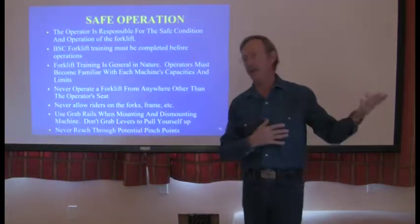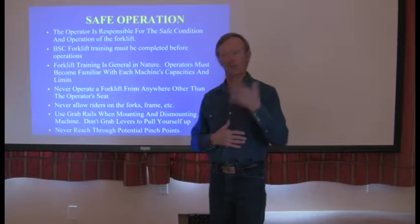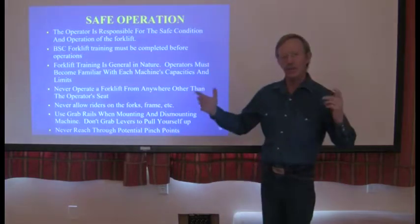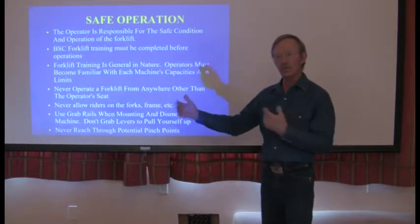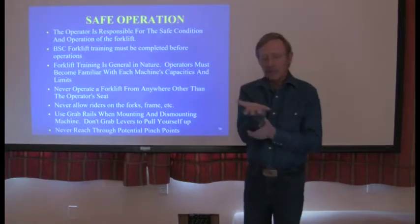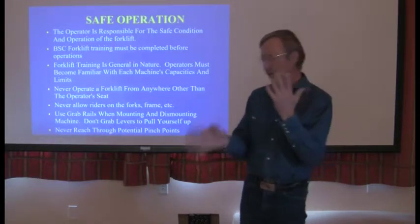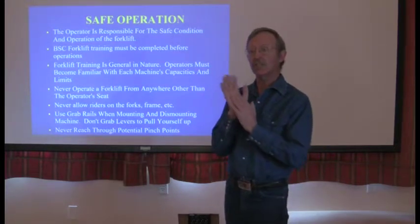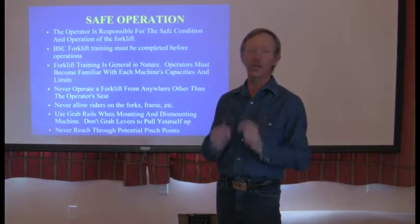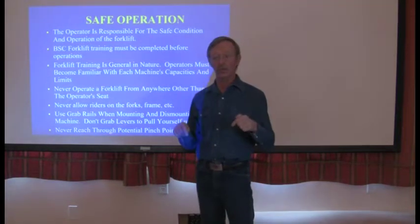No riding around — that's how people get thrown against guardrails and injured. If you have sheeting, plywood, or drywall in the man basket with workers, make sure workers stay to each side of it so a shifting load won't pinch them. Tie the load to the rail so it can't flop forward — if the operator tips the basket and your hand or leg is near the front rail, it's going to smash you. Secure the load every time, no matter how long it takes.